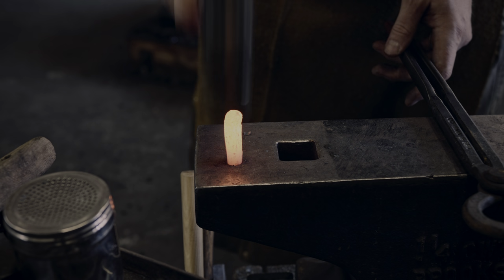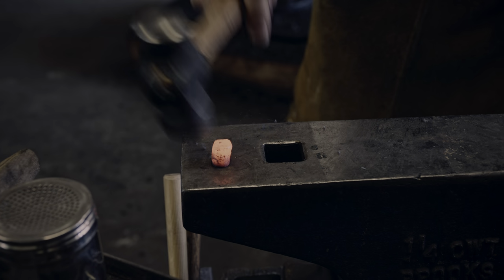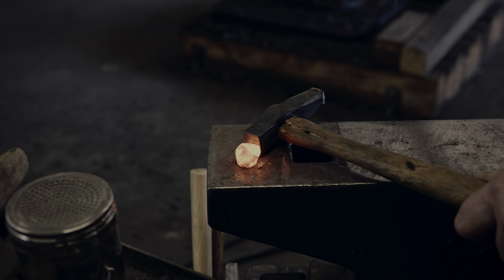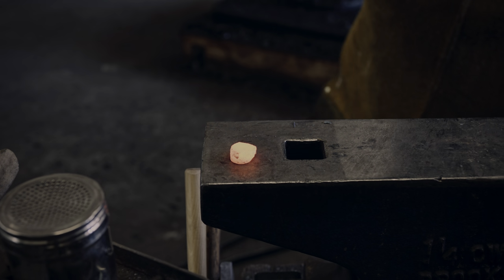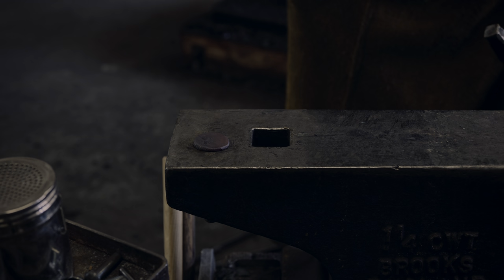The trick with the handle and latch construction in the bandsaw is that the latch is driven by a square hole. As you will see in a moment, that's where blacksmithing can help as well. The flange I'm forging here is meant to secure the handle on the outside so that it does not move through the hole where the handle engages the latch.